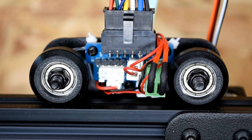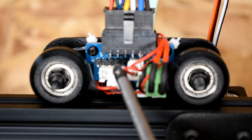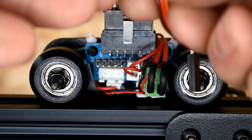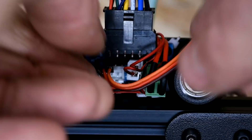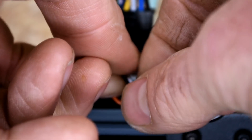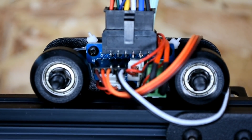With the cable and breakout board, we're going to use the top row of pins — the top five across. Put the three-way block on the first three pins, then the two-way block on the last two pins. The correct orientation for the triple connector is brown, red, orange on the first three pins. The two-pin connector is black then white on the last two pins. So reading left to right: brown, red, orange, black, white — and that's the BL Touch simply installed.